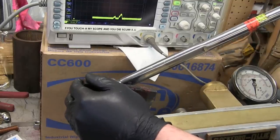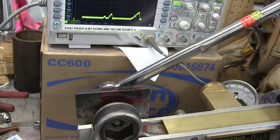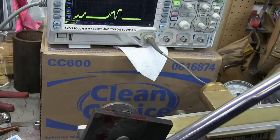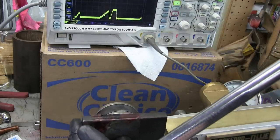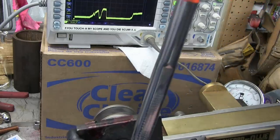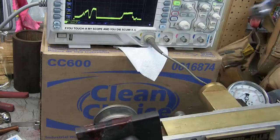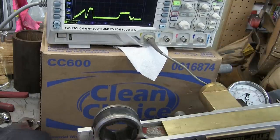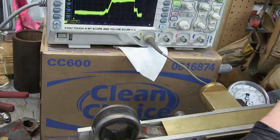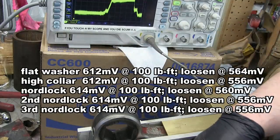We've got two Nord-Locks on this plate now, and the Nord-Locks are bearing on a mild steel plate. We'll get it torqued up and then swap sides. Okay — it's not necessarily harder, but you've got to move through a wider berth to get over that serration. You see here — it actually built up, and it took a long time; that thing was turning the whole time. So that's the difference: less susceptible to vibration, doesn't affect the breakaway torque, but takes longer. That's an interesting result — one I never would have guessed.